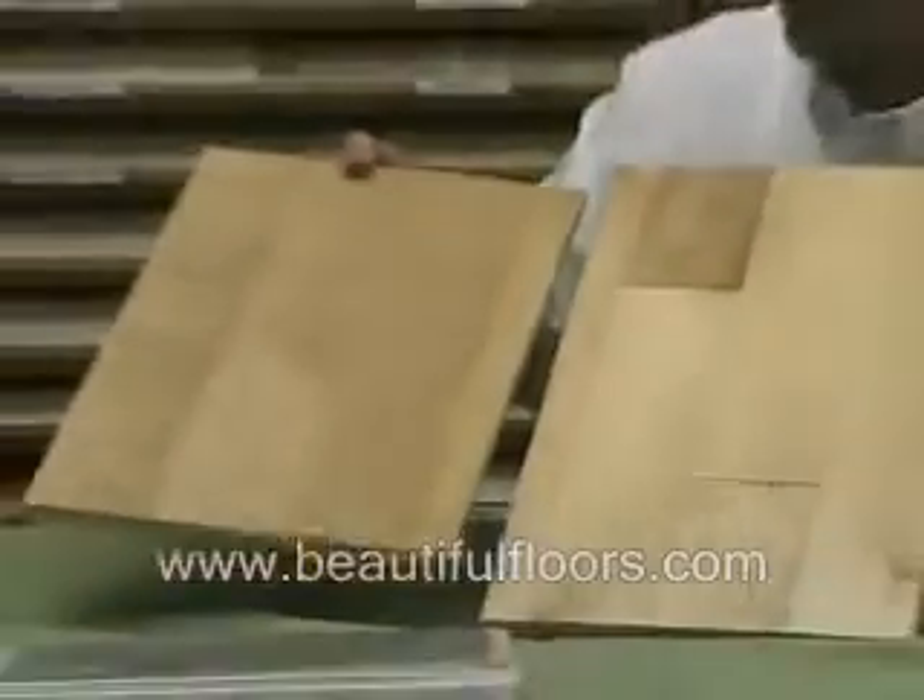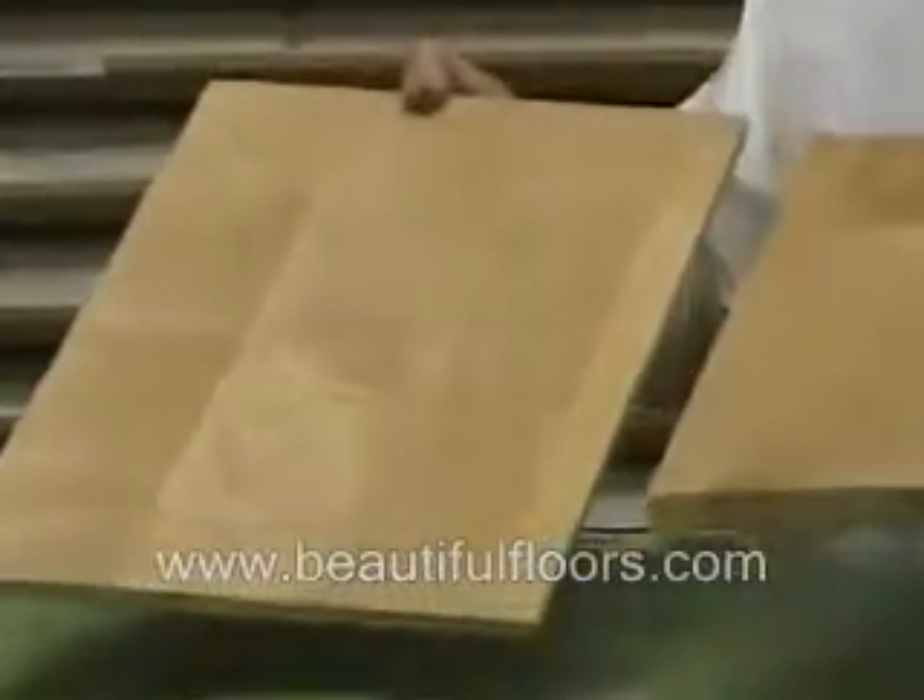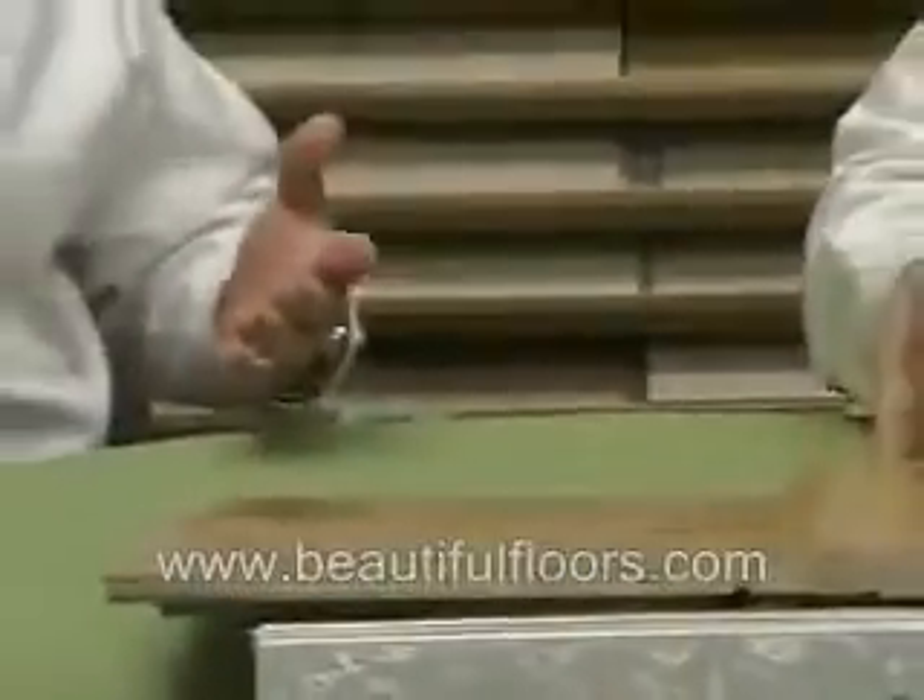In actuality, this would be the better floor because of less movement and less stress on the floor over the length of the floor. You would maintain them both the same way — the same types of cleaners. There is no difference in the maintenance of engineered or solid whatsoever. You do need to worry about humidity more so with the solid than with the engineered.